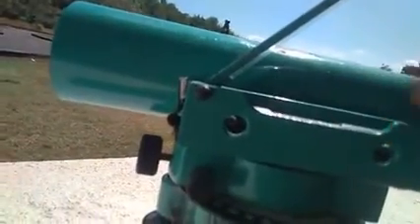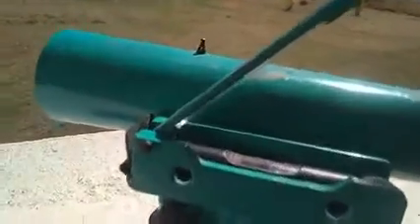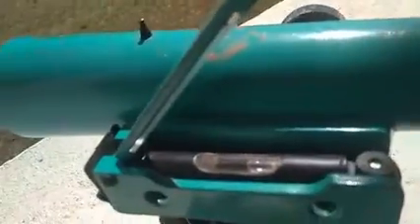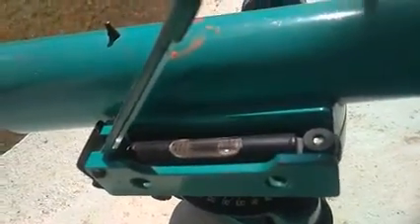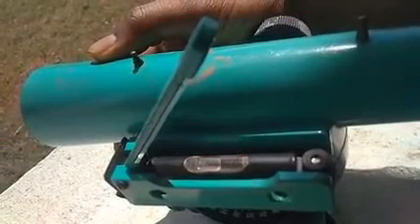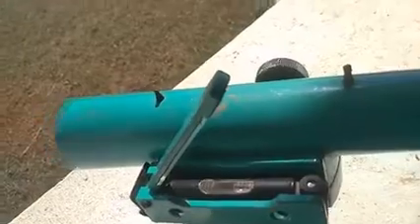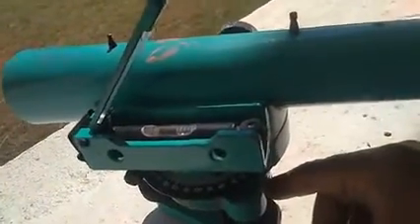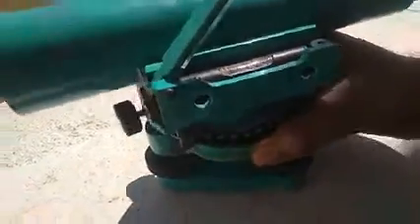The telescope should lie exactly horizontal at 180 degrees. To fix this, you use the spirit level tube. There is a bubble in the spirit level; when you move the instrument the bubble moves, and you must make adjustments until the bubble lies exactly at the center. This adjustment is done using the tripod legs and the foot screws.